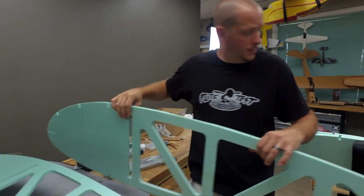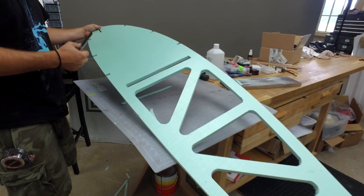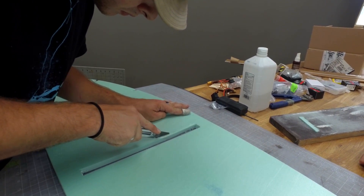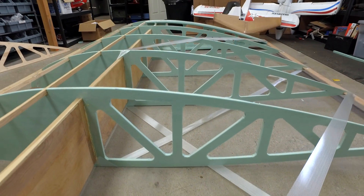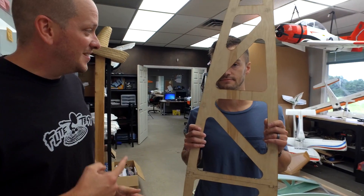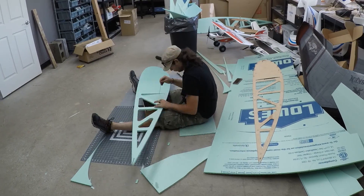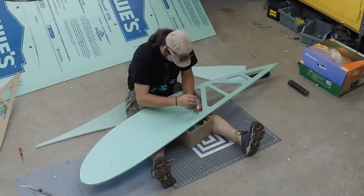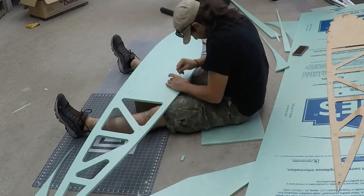The ribs are all made from half-inch foam as well, which Chad cut out by hand. You'd think we'd use a laser for this, but there's no need — the laser with this thickness would cause it to be kind of burnt and beveled. Plus, we don't have a seven-foot bed for our laser, so we'd have to make two-piece wings. The program we used is called DevWing — it's really user-friendly. I was able to print the main template on the laser, and that's what we used to cut out every single rib. Chad Lewis's first day here was doing just that, using a scroll saw device he made to get those curves cut out very quickly.